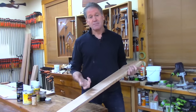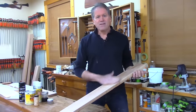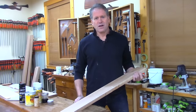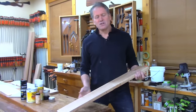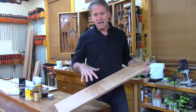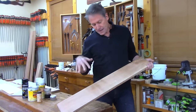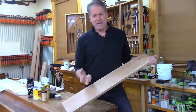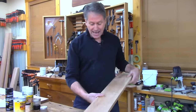Not every cherry board has the potential to blotch. You have to have a perceptiveness when you're handling wood — every board is not the same. If you're trying one approach that doesn't match what's going on with that surface, you're not going to get nice results. But if you come in with the right approach that harmonizes with that particular board, you'll have harmony. Just be observant. This board actually has the potential to blotch — I picked it intentionally.